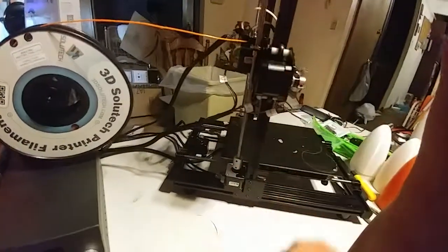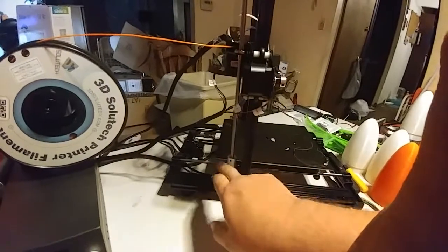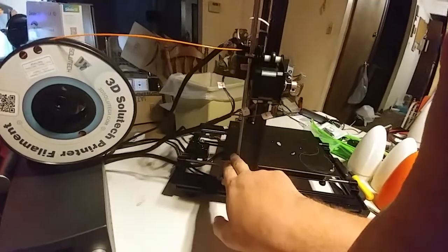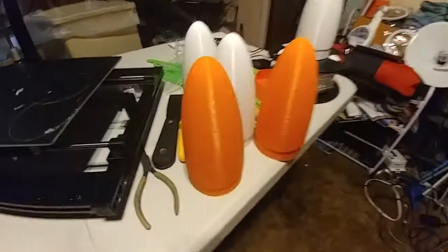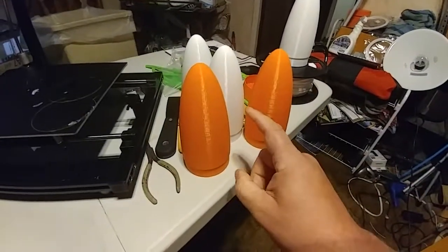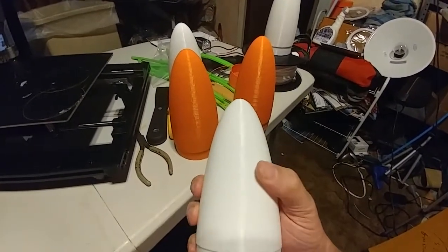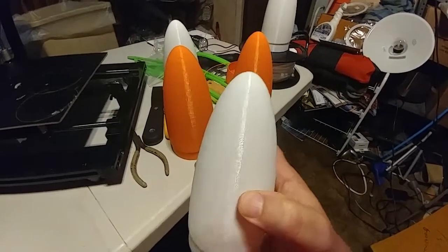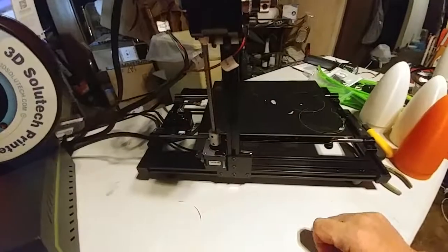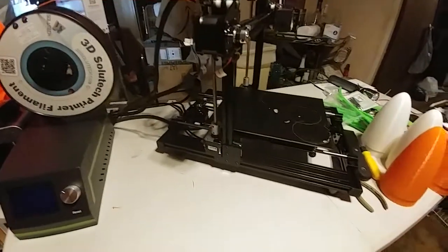To work around my z-wobble problem temporarily, I straightened the rod as best I could manually, then took the bent stepper and swapped the two steppers. This way I have a little bit of wobble in each one, and the two together result in overall less wobble. You can see the before and after correction comparison — this is not a flaw in the printer. The printer was making absolutely flawless prints before my error; even the z-seam is barely visible. This error was 100% my fault — I manhandled the stepper and just turned it, which was a bad idea. So when you get your Anet E10, be sure to make that correction properly.